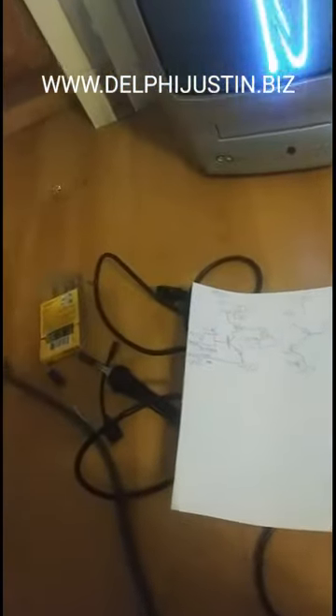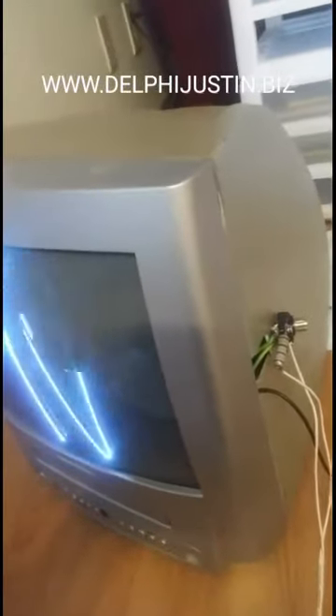Another thing I wanted to show - this TV came with one of those old-style TV transformers used to convert the 300 ohm antenna to a 75 ohm coax connector. I took it apart and removed the transformer from it. It's not a big transformer - it's a ferrite core with some tiny wires on it. It has really low resistance - just wire wrapped around it - so there's no use keeping that.